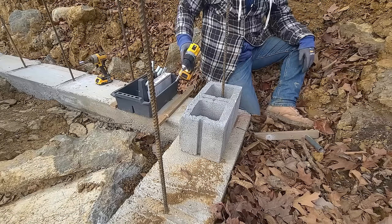And then I measured up to the next eighth increment. So 48 inches, increments of eight. At that point, that's where my string's going to go. 48, I got 56 right here, 64, and all the way up here is 72. All the way down, I have it all the way down to 8 inches. So 8 inches is the top of your line. Now I could take a string from there all the way over to there and mark 8 inches.